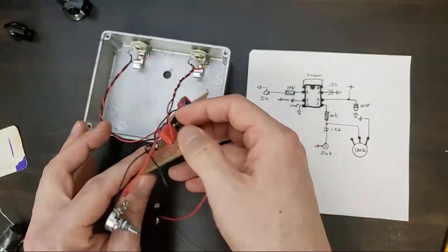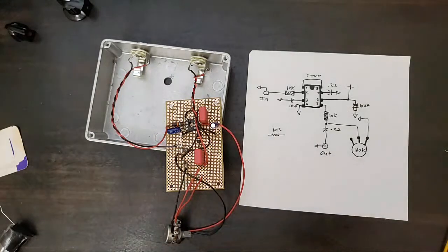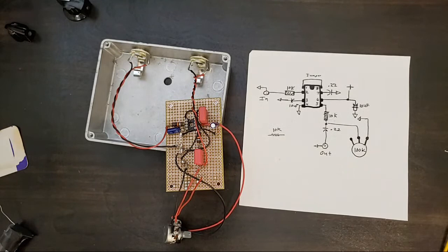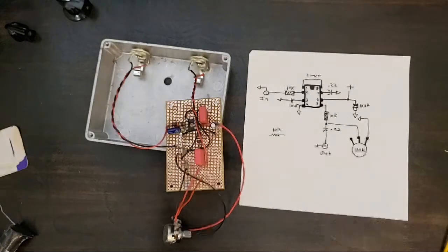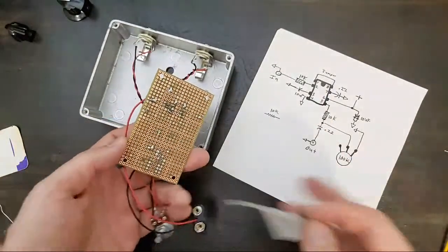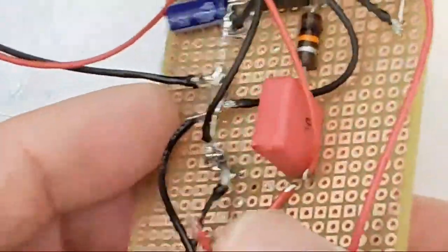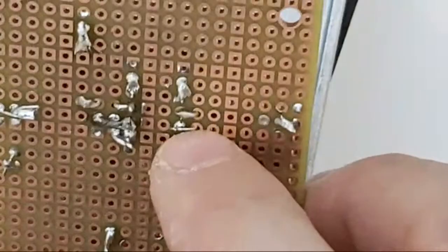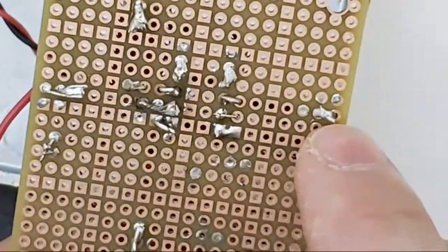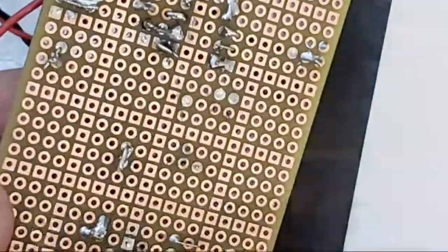to there. So now I'm going to cover the bottom of this with some tape just in case. So this will just isolate the board from the chassis. I'll just double check one more time that all my solder joints are there. Ooh, I see something here. Oh, that's our bus. Good. I don't love that joint, but we'll come back and check if we need to do any troubleshooting. Well, we'll be suspect of that joint.